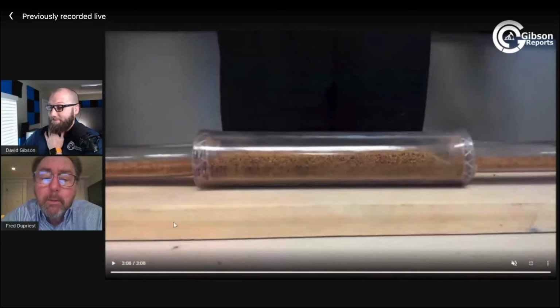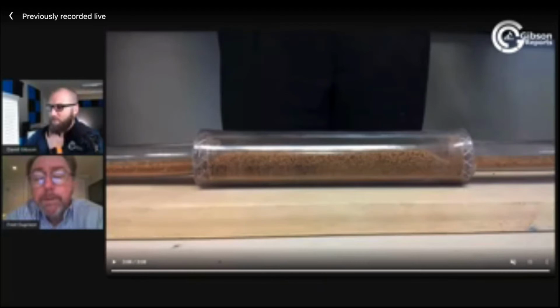So there are some implications here. There's no such thing as a clean hole, number one. Look at the gauge hole there. You don't really care. It's not bothering you. Leave it alone. Just keep drilling. The faster you drill, that equilibrium height will stay about the same, but you'll have a thicker transportable layer on top. The other is that gauge hole is not a problem. It really self-regulates. The stored mass that you're worried about is the stored mass that can exist in the enlarged hole and will absolutely be certain to exist.